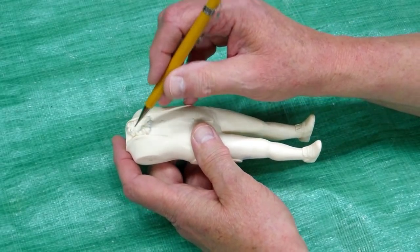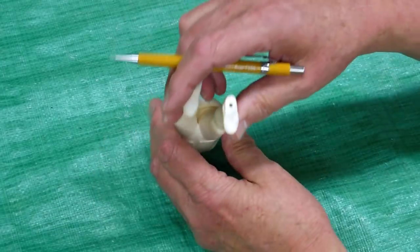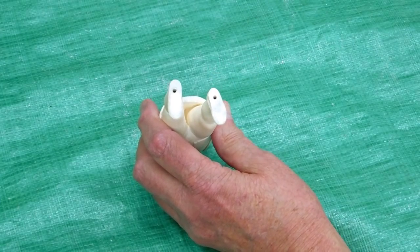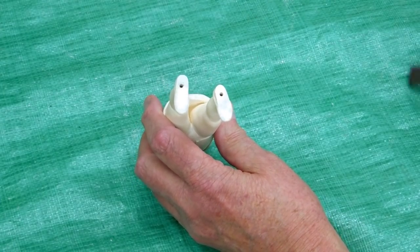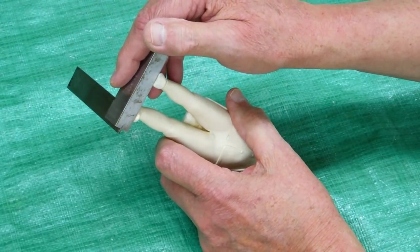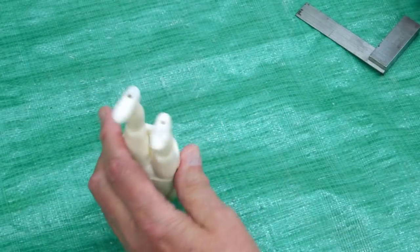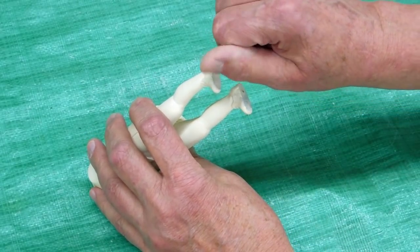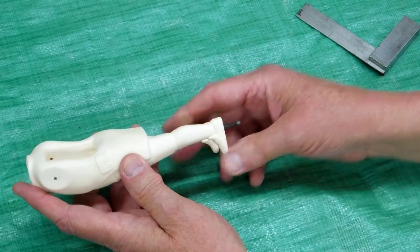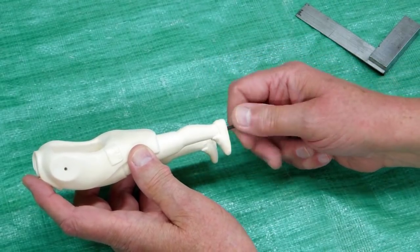A few little bubbles around the ruffle area up here filled in quite easily. When I filled the holes in the feet, I made sure to sand those off flat to make sure they were flat and in the same plane. I drilled and tapped these for a 4-40 screw — that'll be how it's mounted on the platform. That screw goes all the way up in there and these are five-eighths of an inch long.